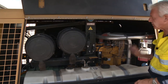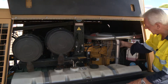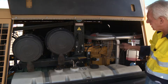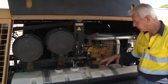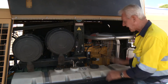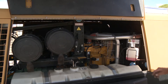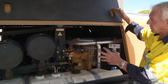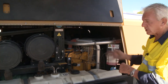What else is there to check? If the machine has been running, don't put your hands on any of these items because they'll be hot. Guards have been installed in areas where items are spinning, like the alternator up the top — there's a guard there for a reason. With the machine stopped, you check fluids such as diesel, water, and oil. Checking those prior to starting is the best approach, so you're not coming back in when the machine's hot and risking burns. When you've finished checking all these items, it's important to reinstate the hatch back into its appropriate position to ensure the cooling aspect of the machine works in accordance with manufacturer's recommendations.